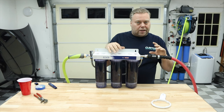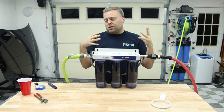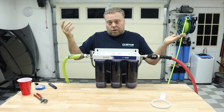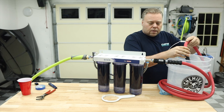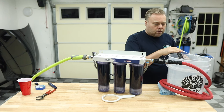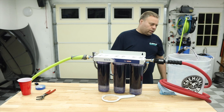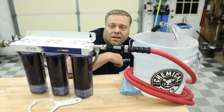Obviously results could differ for other people's water. If you're struggling to get to zero PPM you need larger systems with more surface area. I turned off the carbon filters on my water drop setup and ran it on bypass so it wouldn't affect the lifespan of this unit, since this doesn't come with a carbon filter. With full flow, the meter dipping into the water caused a slight reading drop — taking it out brought it back to 2.1 gallons per minute. Zero PPM confirmed.